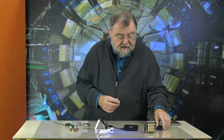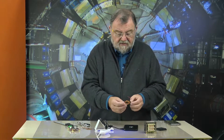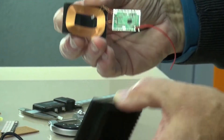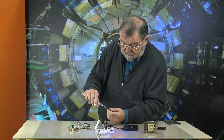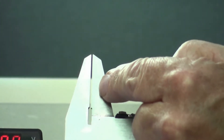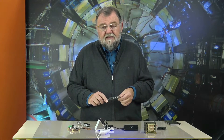And now it is totally clear how to measure a coating thickness. I go with my coil — which I have in any sensor — onto the material. Inside the coil a magnetic field is made, it is sent out, and in the material an eddy current is generated, causing more electricity to flow through the coil. Today's measuring devices are high precision — you can measure coating thickness up to 0.1 micrometers. A millimeter is a thousandth of a meter; a micrometer is a thousandth of a millimeter; and 0.1 mu is a tenth of that. That is what these devices resolve.